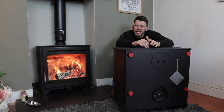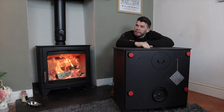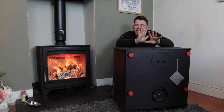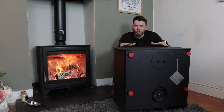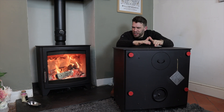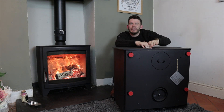That doesn't mean you get free heat, because if this stove is a big powerful beast — which it is, a sort of 15 kilowatt stove — you might be losing half of that, or three quarters, or all of that when the system's cold. All of that heat is going into the water. Then as the water gets up to temperature, you might get more heat to the room. But the whole idea is that this stove could be put into a smaller room and run the entire house — and certainly your hot water.